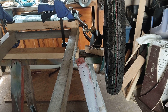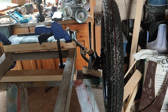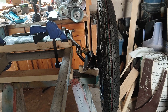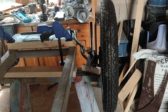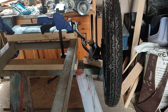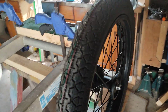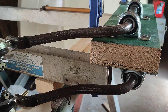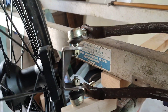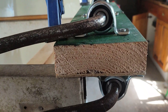The suspension isn't going to work on a torsion bar — I'm going to work on a lever and spring, probably a rubber spring, rubber cone parabolic spring. These are early days. The calculations were about whether I'd get the wheel lock, whether I'd be able to get the movement in each side of the suspension system, and how the fixing and attachment points are going to work. So I've mocked up a very rudimentary parallel arm system. You can see the arms are set parallel to each other.